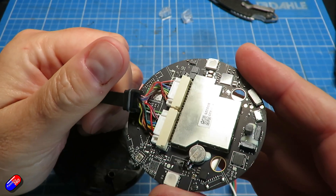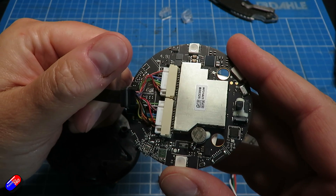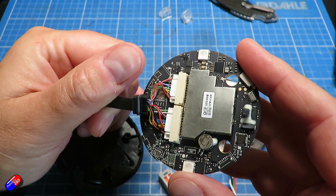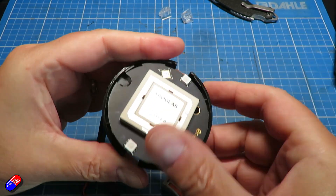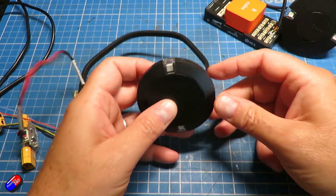In the case of the Here4, there's enough intelligence not only for it to be a GPS and a compass, but inside there's also a single IMU — it's not vibration isolated or anything like that. But it means there's a processor, there's memory, there's a GPS, there's a compass, there's an IMU. That's a flight controller, isn't it? Yeah, it actually is.